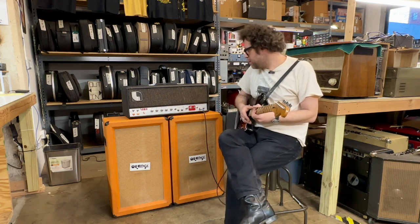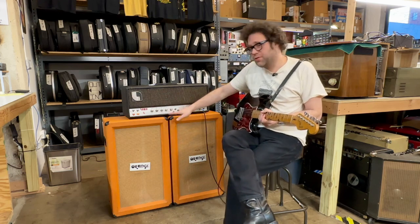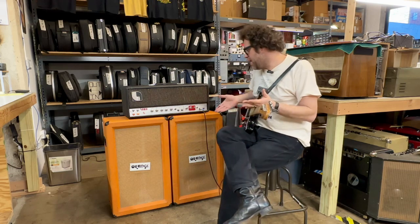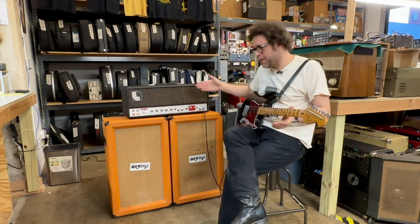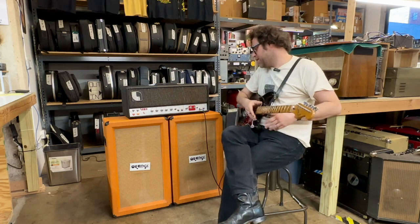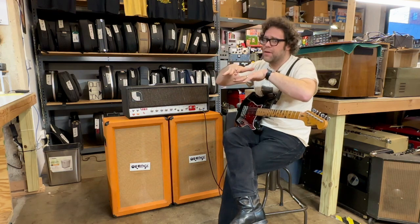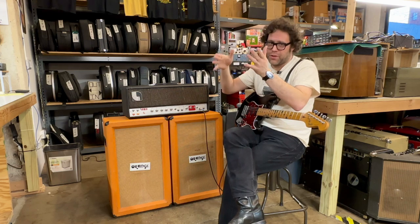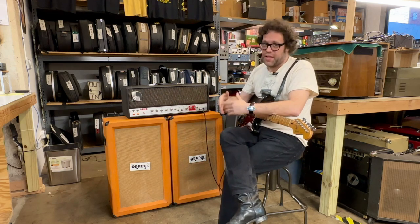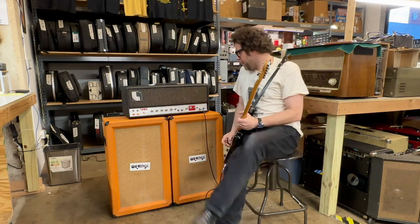The history of these amps varies depending on what you read, but in short, this is a two-channel amp basically built for Tony Iommi of Black Sabbath. He was a Laney guy, and his whole thing from the beginning was a Range Master pedal into a Laney. So they built a tube distortion into a head for him — pretty awesome. That's why it's called the Clip circuit. The clip circuit works like a long-tail phase inverter, but with not a lot of B-plus voltage on it. It's not made to do phase inversion to drive power tubes; it's just made to distort. You have a blend control and a switch to take it out, so it's pretty versatile. It really does give you that kind of solid-state transistor distortion.